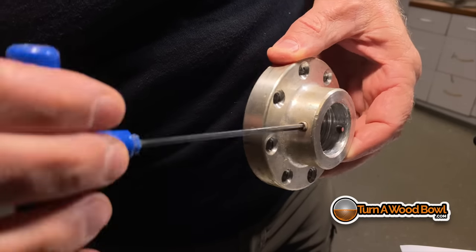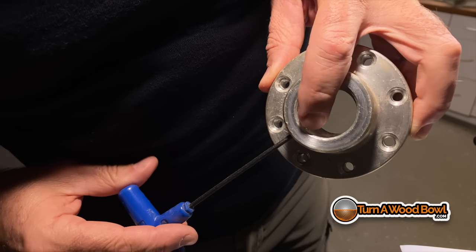Just remember: if you're left-handed and you reverse the orientation of the lathe when you're turning, you need to use a set screw with all of your screw-on attachments — such as your chuck and your faceplate. If you get a little catch, the orientation of the lathe going in reverse will unthread those attachments very quickly. At 800 RPMs with eight threads per inch on your headstock, you're getting about three quarters of a second for that chuck or faceplate to unscrew itself and come off the lathe. So use a set screw if you're running your lathe in reverse. Get a glove to protect the hand closest to your turning.